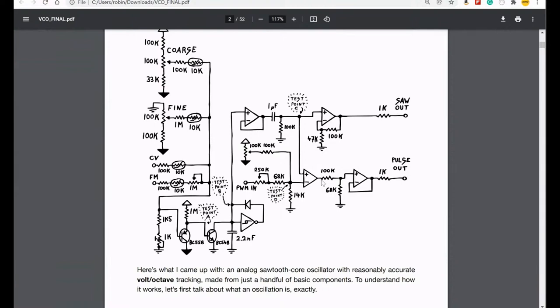And so once I'd made that decision, I think things started coming together. But of course, not immediately, because my bloody batteries kept falling out every time I was plugging something in. And it didn't work immediately. But after a bit of shuffling, a bit of fussing around, convincing myself that that was the problem, I took a 100k resistor and plugged it between pin 7 and whatever the 68k was on. And it came to life. Thank goodness.